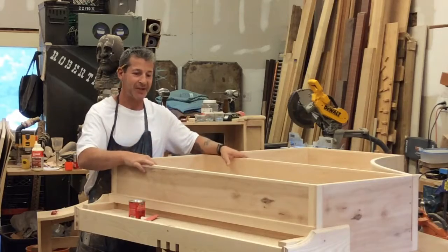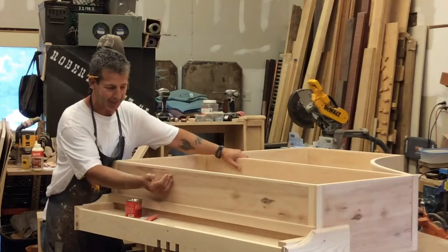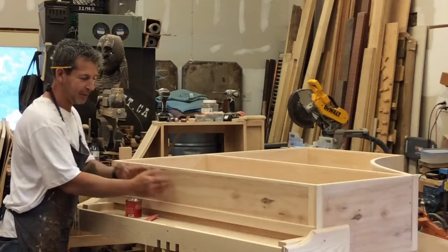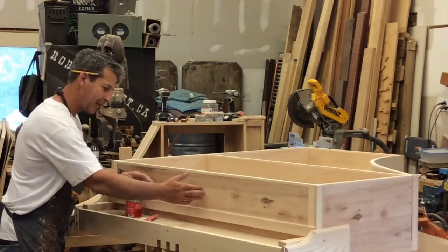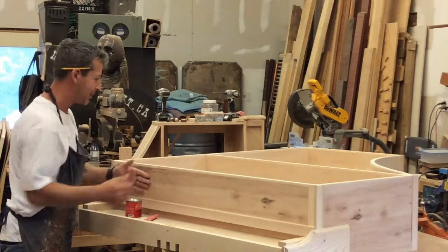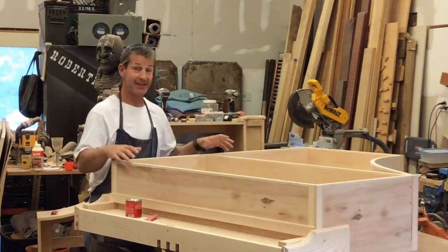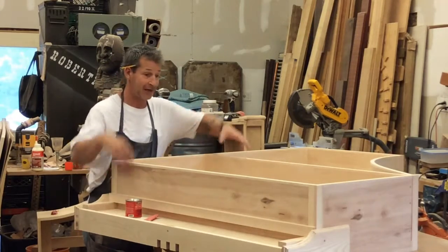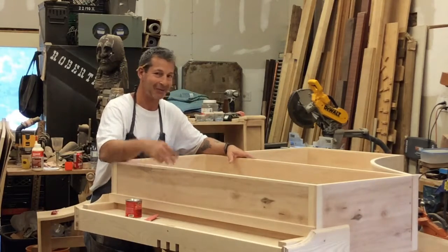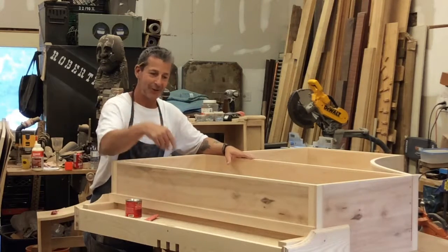So when you're doing a piece this size, you gotta keep a wet edge. And for those of you that don't know what that means, if you're staining and you stop here and then move the staining in here, when you come back over here, if that bit of stain you put there is dry, when you start staining and that wet stain now meets that dry stain, you're gonna have a really dark spot there where the wet stain meets dry stain. So that's what it means when I say you wanna keep a wet edge. And on a piece this size, to get the bottoms, the fronts, the sides, the back, and keeping a wet edge, it's go time. I mean, I'm running around here like a cartoon. So I'll get that done.